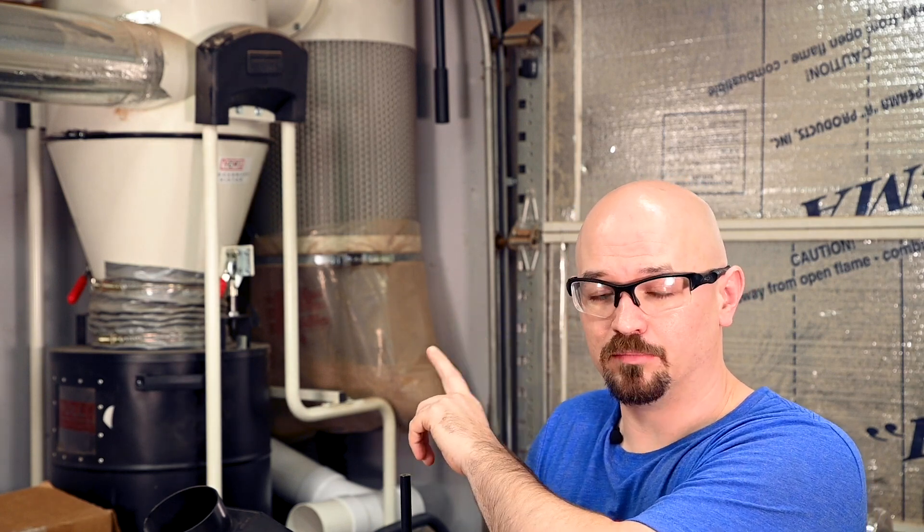All units I can think of have some type of filter, but it may not be doing what you think it's doing. The unit I have has a good pleated filter. A lot of the really inexpensive dust collectors you see have a bag that acts as a filter, and those are only rated to capture particles down to 5 microns. So everything under 5 microns basically gets sucked up and blown out the bag to be distributed throughout the shop — great for collecting the nuisance big chips, but all that fine stuff under 5 microns is the stuff that's actually carcinogenic and really hurts your lungs.